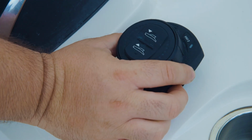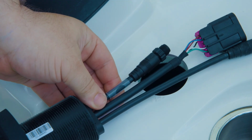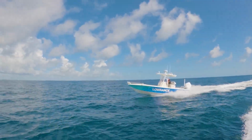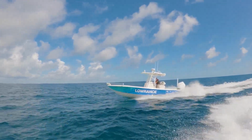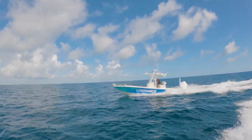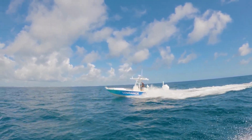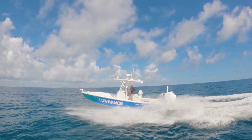The Pro Control Auto keypad has three different CAN connectors on the rear. The short connection is for the Lenco 2K network. This is a private connection between the keypad and actuators. Those familiar with NMEA 2000 style networking components will recognize many commonalities between the Lenco 2K and NMEA 2000 networks. However, the two networks should never be interconnected. Aside from the actuators, Ts, terminators, power drop, and the keypad's Lenco 2K connection only, nothing else should be connected to the Lenco 2K network.